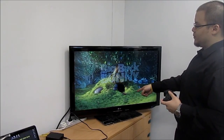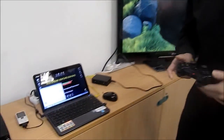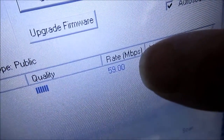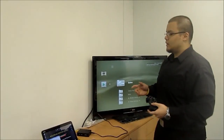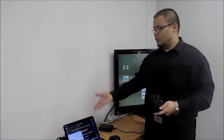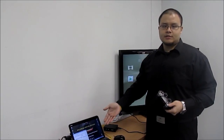There you can see a little bit of lag on both the audio and visual. The connection rate here shows approximately 55 Mbps — it's just gone up to 59 thereabouts. You can see immediately that if you actually share one wall outlet with the powerline adapter and your interconnected equipment, your connection rate suffers. If you turn on noise generating equipment like your mobile phone charger, it causes the connection rate to suffer as well.